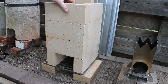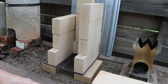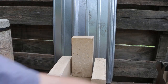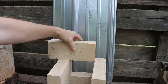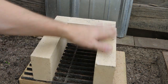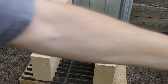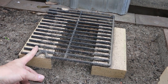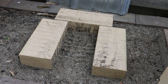I've got it stacked up to show you how I chose to build this. I've seen a lot of brick rocket stoves on the internet using the bricks horizontally flat — I chose to use them vertically. There's plenty of surface area to make this stable, especially if we add some mortar. It lets us have the verticality and rise that's important for airflow, and it also lets us use fewer bricks. The base layer is three bricks stacked flat just for stability.